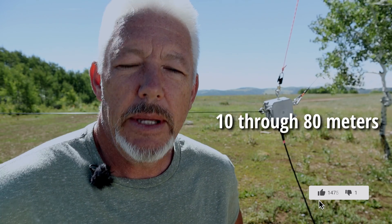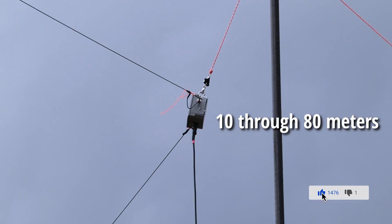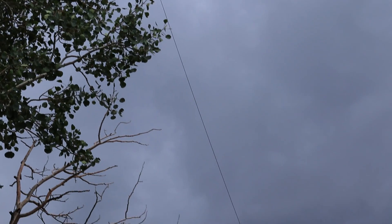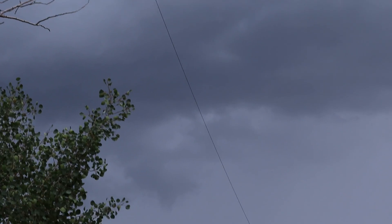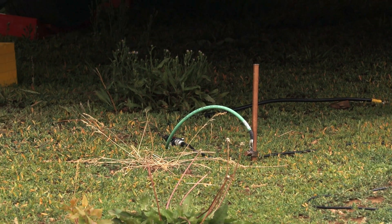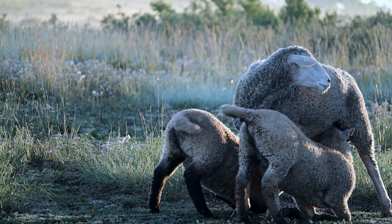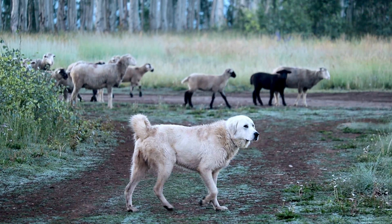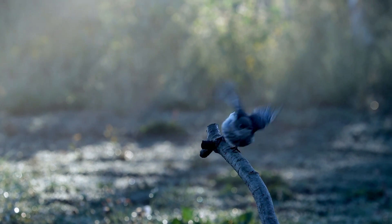This antenna build was an awful lot of fun. The 80 meter full wave loop connected to the four-to-one current balun — I've got it up 25 feet in the air in kind of a rectangle shape, and it's worked really well. I'm really pleased with the performance so far — the things I got to hear, the things I didn't have to hear. Hopefully I'll have more experience and more fun times with this at my QTH. Make sure to click that like button, and if you're new here consider subscribing to get more videos like this. Thanks for watching, and I'll see you guys on the next one.